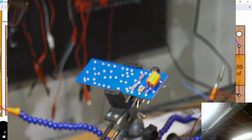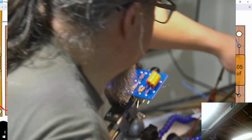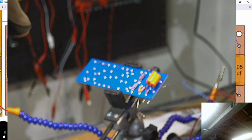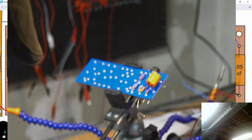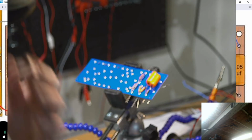All right, next we will be hooking up. Okay, so here's one of the parts that for me will be a bit challenging. We now have a small variable resistor, a potentiometer, that goes here. One of the things I've done a bit wrong on this one by accident is that it says 345K. I couldn't find a 300 or 345 or a 350. I think I could only find a 300 or 400, so I chose 300, and this may be wrong, because I think this is the adjustment for the drive, if I remember. You want this to be in the right range, so I might have to replace this if I put the amp together and it's just not adjusting the way I want. But in the interim, we will get this guy and put it in. Now, I think if I'm looking at that right, oh, it's another thing I'm not sure I'm getting all of, no, actually that's good.